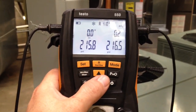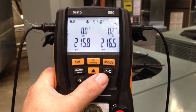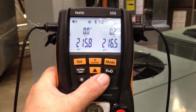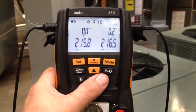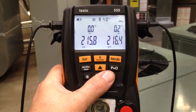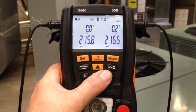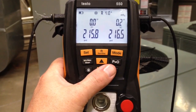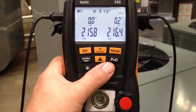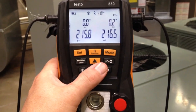If I scroll down another time, you'll see I've got no superheat and two-tenths of a degree of subcooling — and that's more or less the total uncertainty of the gauge at this point. The digital gauge is making a measurement of temperature with a clamp and a measurement of pressure with the pressure transducers, and it's calculating the actual superheat and subcooling right at this time.